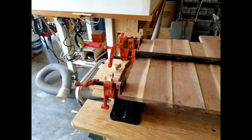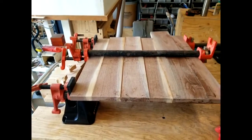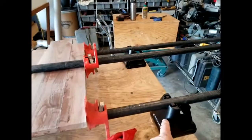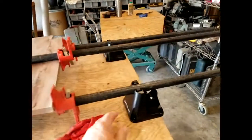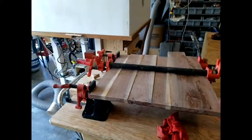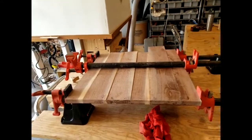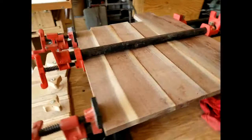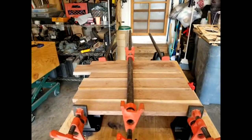It would be nice to have a table sander, but I can hit it with a belt sander and clean it up pretty quick. These clamp clips were really nice — I enjoyed using them. Usually it's a fight, but this wasn't a fight. They allow you to turn the board without the clamps interfering with the table, so your clamps are much more portable. It made for a lot more pleasant glue-up job. And the board is square and ready to go.